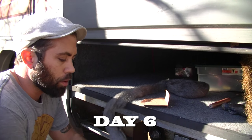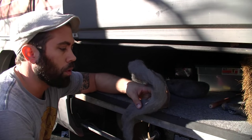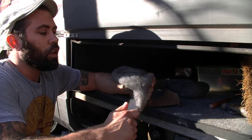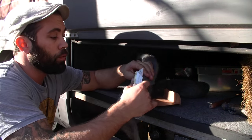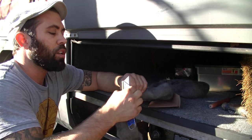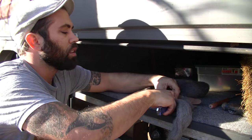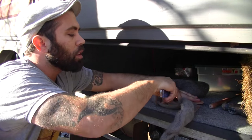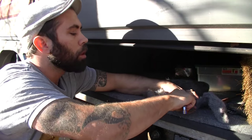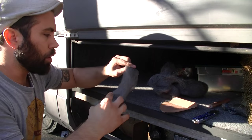I'm going to seal up all these holes. In a household or RV, it's good to shove some steel wool in there before you do it. That's for rodents and such, especially because they could follow the wires up into it, and they can chew through wood, and wires, and cheese, and peanut butter, and chocolate bars, and pasta, and carpet, all kinds of stuff. But when they start chewing through steel wool, it starts messing with their gums. So then they back away. They back away slow. So I shove this down inside the hole here.